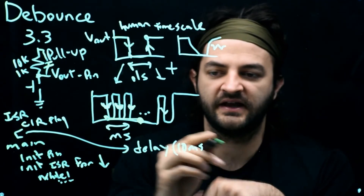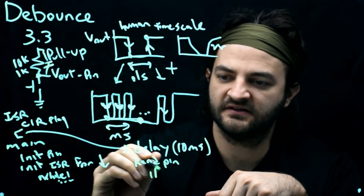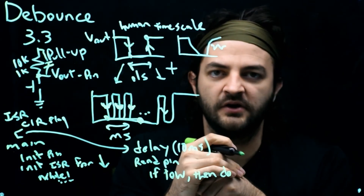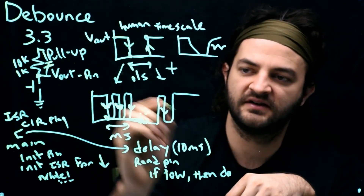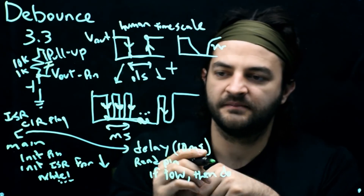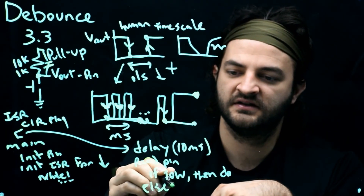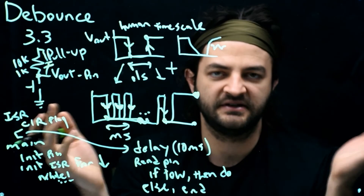We read the voltage on the pin. If the pin is still low after the 10ms delay, then do whatever you wanted to do — we got into the ISR, waited 10 milliseconds, and the pin is still low, so we're not in a bouncing situation. Add one to our variable. If you then let go of the button and the ISR triggers again due to a bounce, we clear the flag, delay 10 milliseconds, and read the pin. If it's high after 10ms, that means it was a bounce — just end without counting. Because a high-to-low followed by high again after 10ms means it was a bounce, so we ignore it.